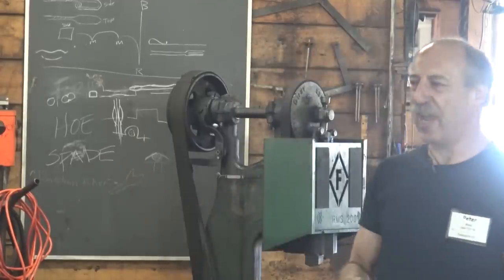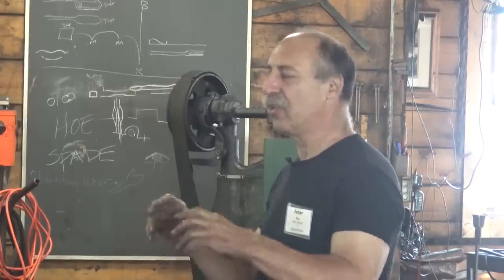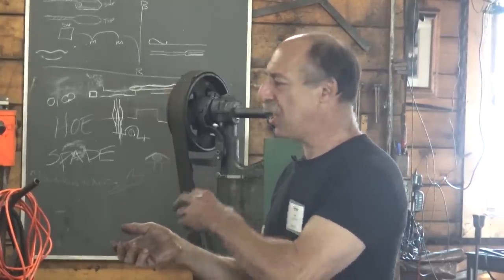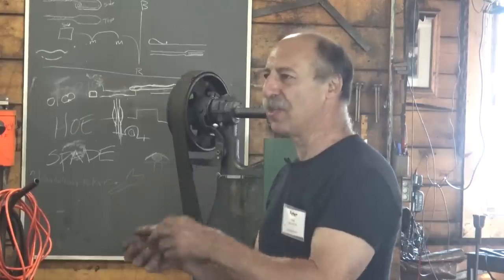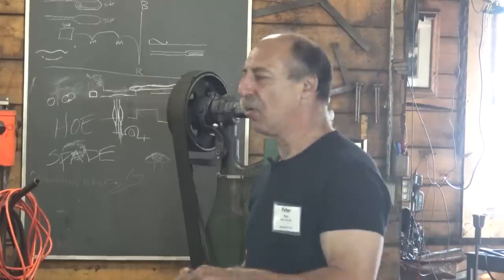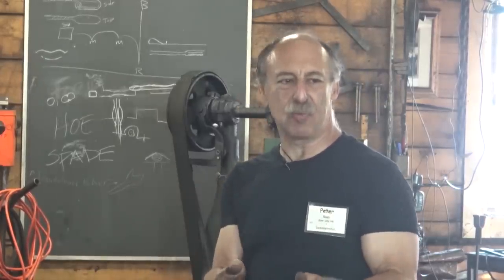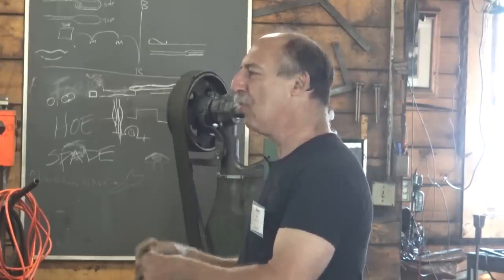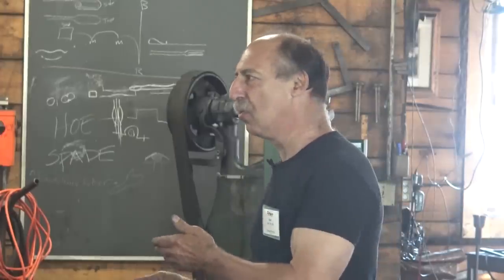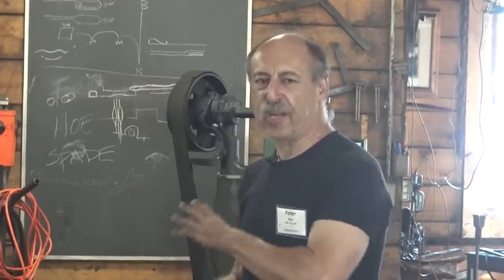So they had no way really of analyzing other than by visual inspection. You could quench that bar and break it, and you could see that it was different on the surface and the core. And you could tell by working it too. So they knew it was irregular, but it was the lowest price. That's the lowest price steel you could buy. If you want better steel, we can improve it several ways. It costs more. The first way they could do that was to fold that bar and weld the stack and draw it back out again.